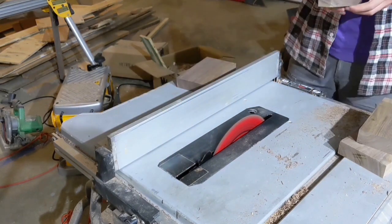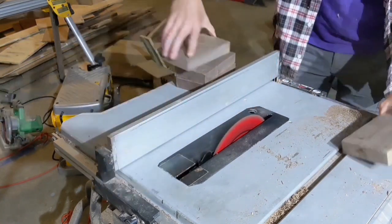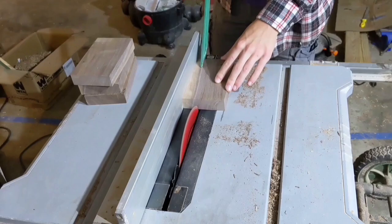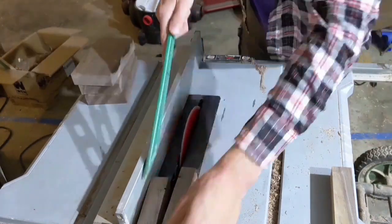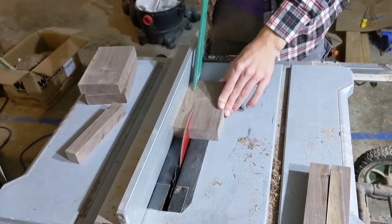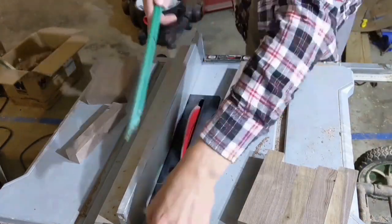Now the first thing I did was break down a rough cut piece of walnut into smaller pieces that were about 7 inches long by 4 inches wide. These will be used to make all of the bookmatched tops. I decided to make the bottoms using the same technique, because a top that is a different color than the bottom might surprise people when they open it up and actually see the bottom for the first time.